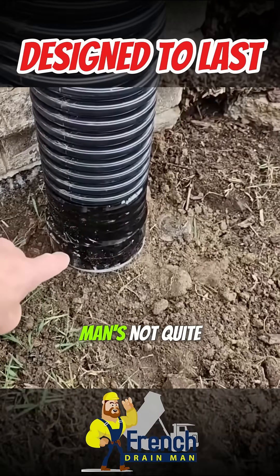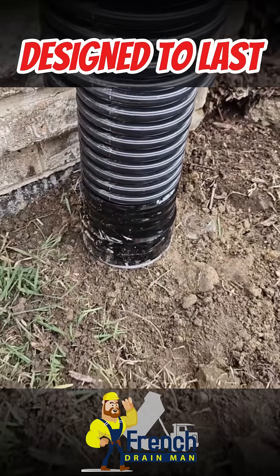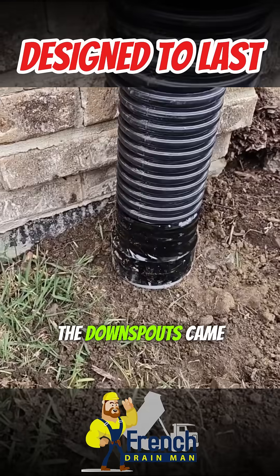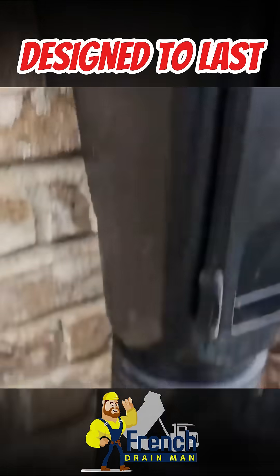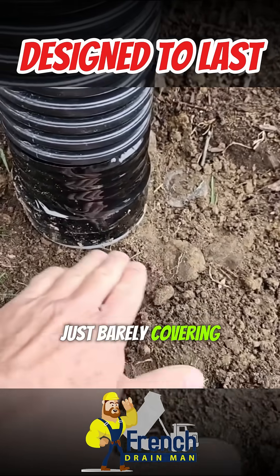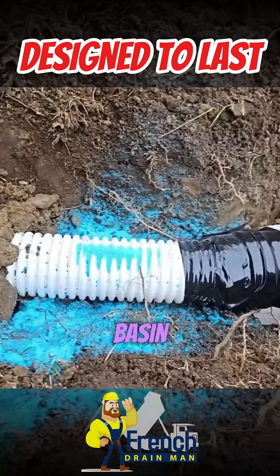The French drain man 'not quite a 90' fitting is not quite a 90-degree angle. Look at that fitting sticking up right here — they had to tape this. We needed a full riser. The gutters were high here, and the downspouts came down and right away went into some fittings. This is a beautiful example of starting as high as you can, just barely covering the French drain man fitting — it's not quite a 90 — with some dirt so that you can get slope to your catch basin.